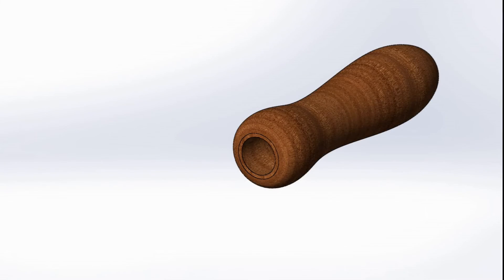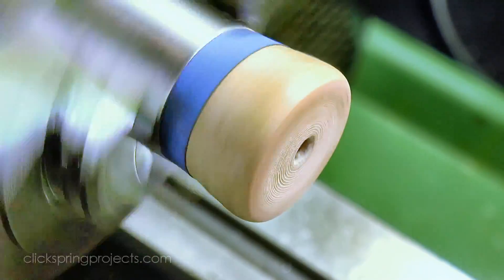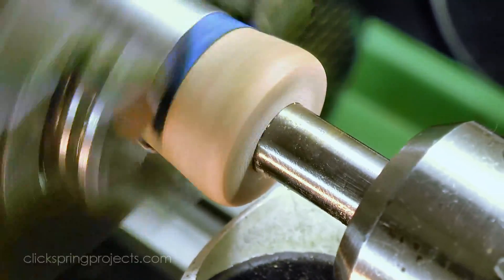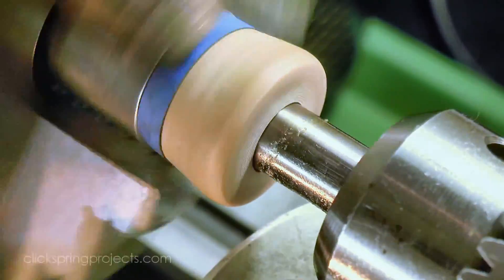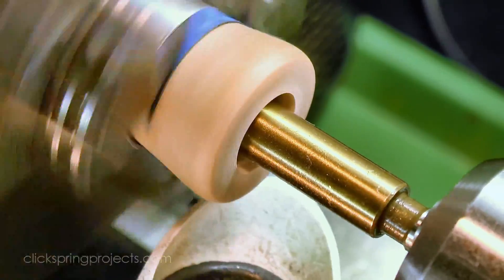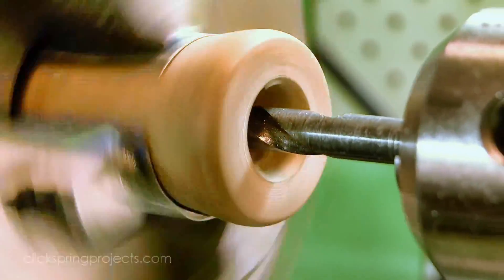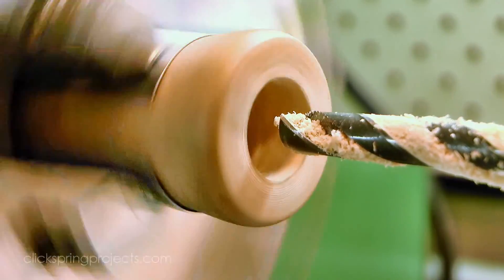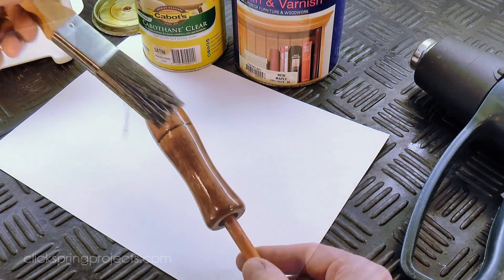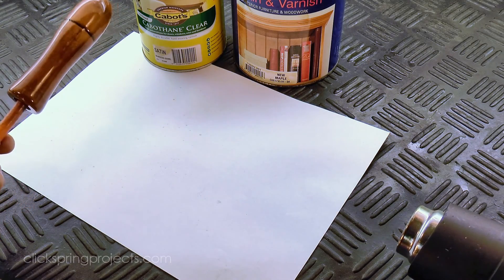Let's take a look at the handle. I mentioned before that I'm using a commercially manufactured product, and they come equipped with a steel ferrule — so that needs to go, and then the center needs to be drilled out. Now there's an existing hole, but it's wildly off center. A D bit won't track an existing pilot hole, so it's the perfect cutting tool to take it out, and then this Forstner bit was used to bring the hole to size. With the main bore taken care of, I drilled the through hole that will permit long stock to be accommodated by the vice. A quick stain and finish with polyurethane, and the result is quite a presentable little handle for the tool.